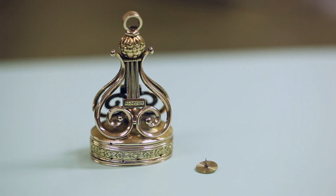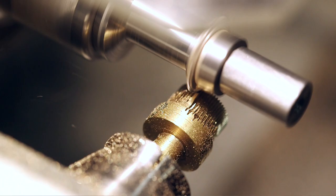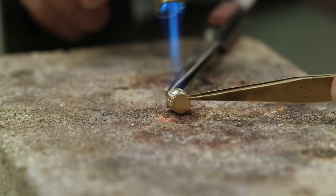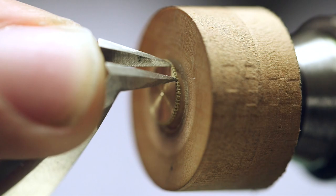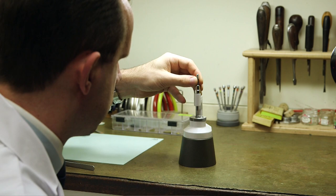It was not working because of missing parts — also some parts were broken. I've made a wheel and two pinions for the mechanism. The wheels were made by cutting little teeth with a profiled cutter; one of them has 56 teeth on it, and was then put in the watchmaker's lathe to finish it, make it look the way it's supposed to, and drill the holes in the centre. The hardest part was making the tiniest pinion inside the mechanism itself, which had a diameter of one millimeter and was produced to very high tolerance.